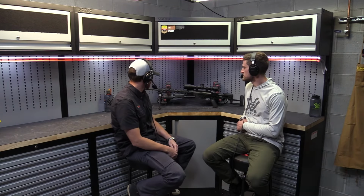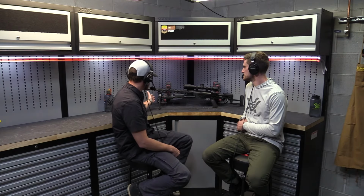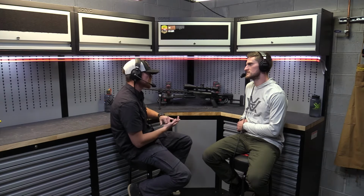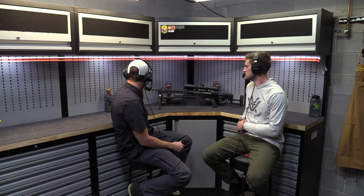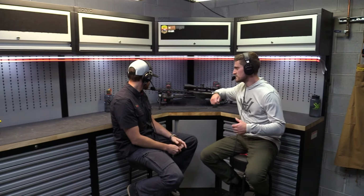Yes, it was. Something else that you mentioned is any little adjustments you do. So you mentioned the action screws. Also, I've seen bipods, believe it or not, whether you have them loaded or a neutral load, affecting your shot groups as well. Yeah, sometimes if you have a forend that's a little bit flexible and the bipod's mounted on the end of it, as you load into it, it can cause the forend to come up, touch the barrel, and now we've changed the barrel harmonics, which is causing inaccuracies.